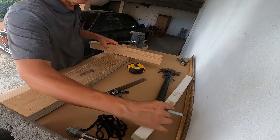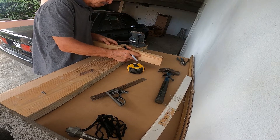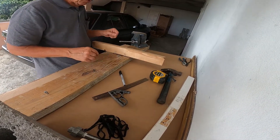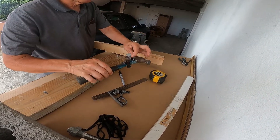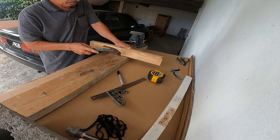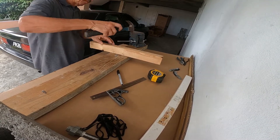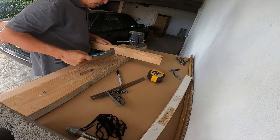The action is about 32 inches long, so I'm locating the first two by three five inches away. That's five inches, and I'm just going to tack this down using some inch and a half finishing nails. So that's done.